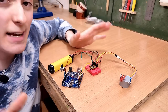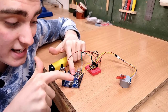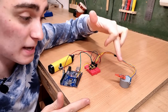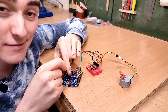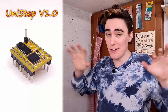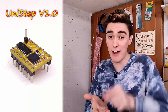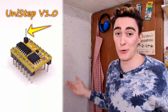Here I have the exact same setup and code I frequently use with the A4988 — an Arduino sending step and direction signals to the driver, allowing me to control the direction and speed of the stepper motor using a potentiometer. And as you can see, it works just fine. This stepper driver was designed to be fully compatible with CNC shields, RAMPS, and all other 3D printer control boards with plug-in drivers.